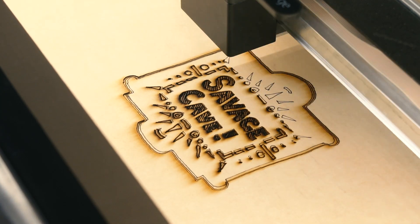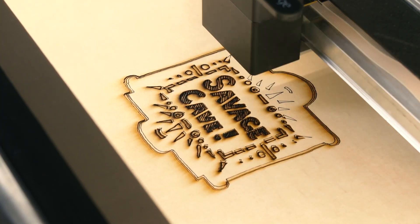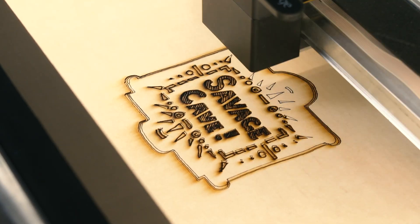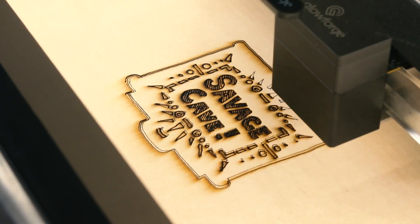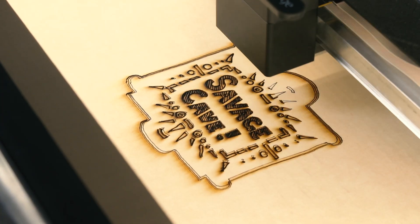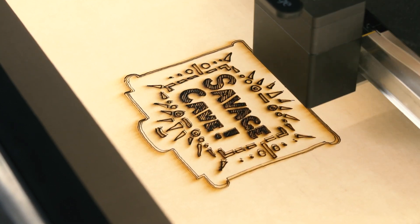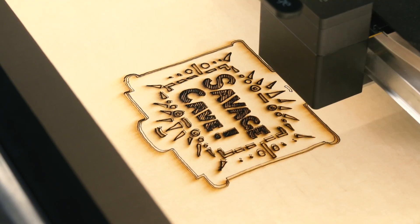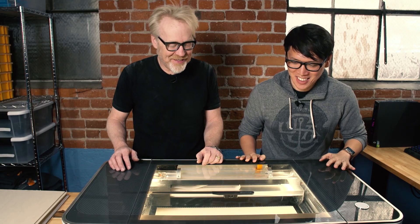You're never going to use 1300 DPI on hardwood, but for aluminum that lets you get really fine lines without seeing horizontal etch lines. What the pre-release unit can't do yet: full bed access - right now it's about 18.5 by 10 inches instead of the full 20 by 12. The 3D multi-point autofocus isn't turned on yet either, so it can't automatically recognize the height of curved objects to etch on them. Right now the macro camera on the lens head focuses at the center of your material, which has worked okay. Looking forward to those updates - let's go check on that cut.